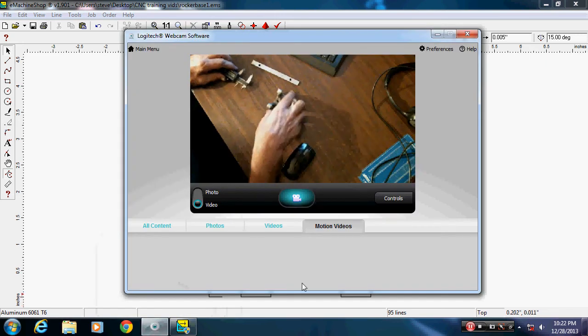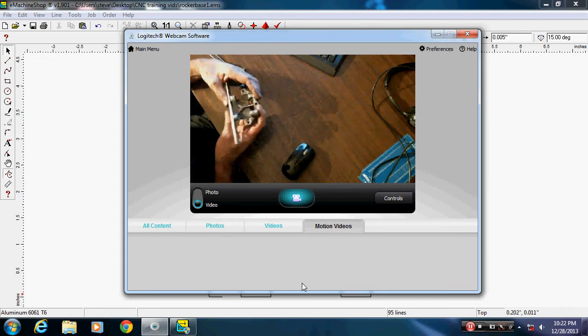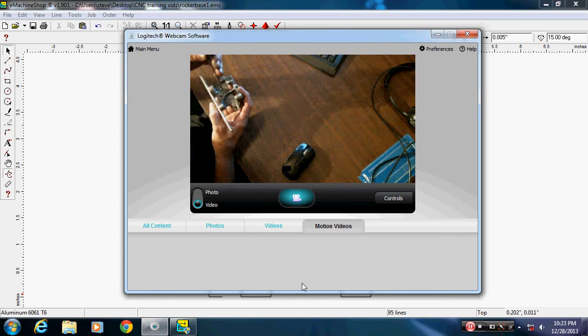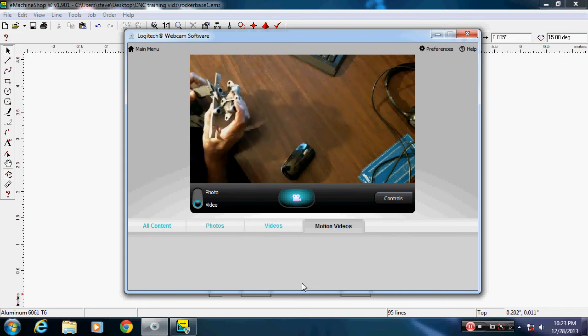So coming back to the part here, what I did when I measured this was I held it like this, and I got a measurement from here to where these two lines right here and right here intersect up into this part. Just a guided measurement. Now, you probably saw me measuring from the outside of this parallel, and what I failed to show you was that before I measured this, I zeroed the caliper on the parallel.